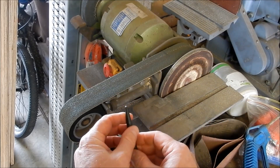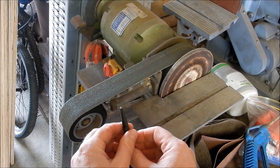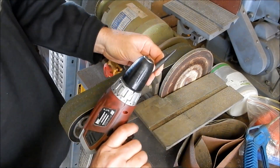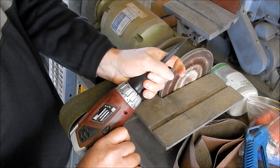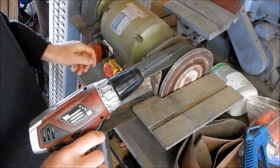So this is a little trick I use to get them nice and concentric and a nice point on them as well. It's fairly basic — centre punch, battery drill. You put the centre punch in the battery drill, and you can do this with a grinder as well.